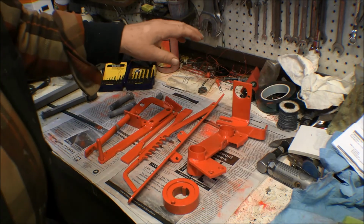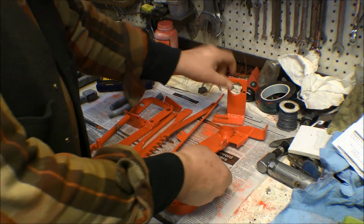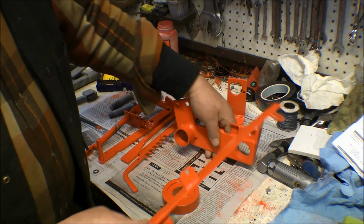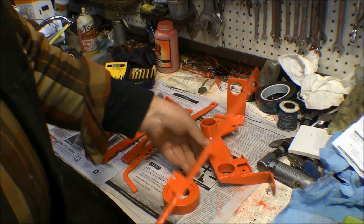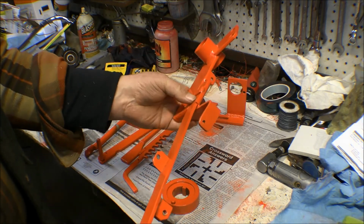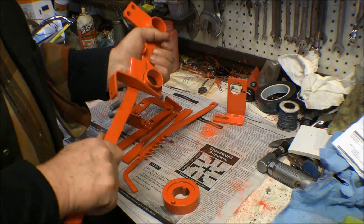These pieces are all powder coated, all done. This is one of them that the hole was elongated on, and I welded it up and filled it up and then re-drilled it. There's just one hole in this one right here that I filled and re-drilled. This one had two holes, this one and this flange. Tight in there now with the powder in it. Oh, there it goes, just like it's supposed to. That'll have a bolt go through there to hold that on, and then this gets all the pulleys and stuff on it for adjusting, reversing, and forward on the carriage travel and whatnot.